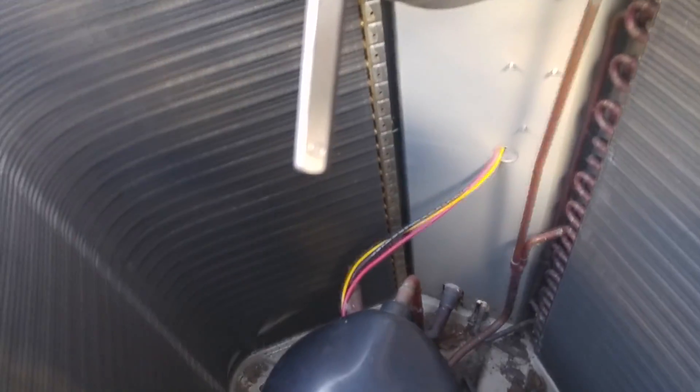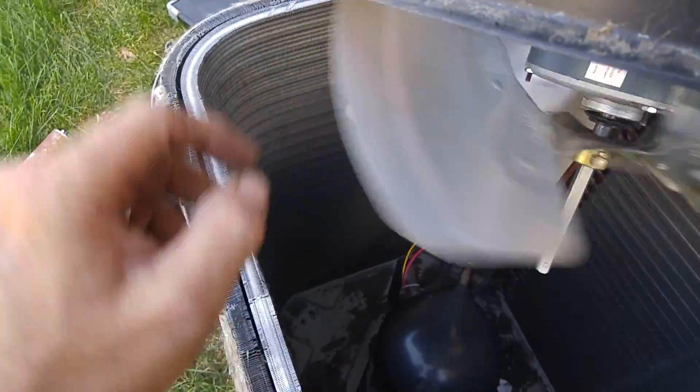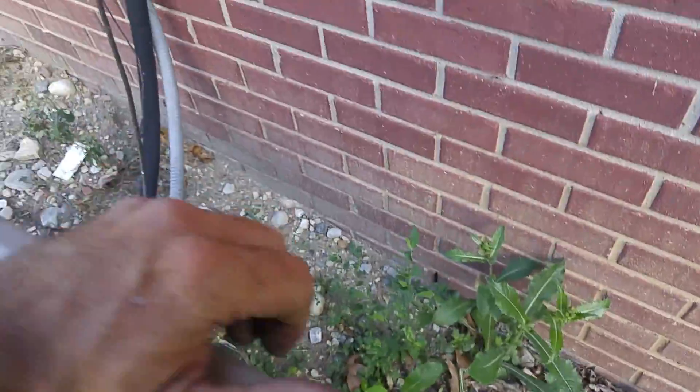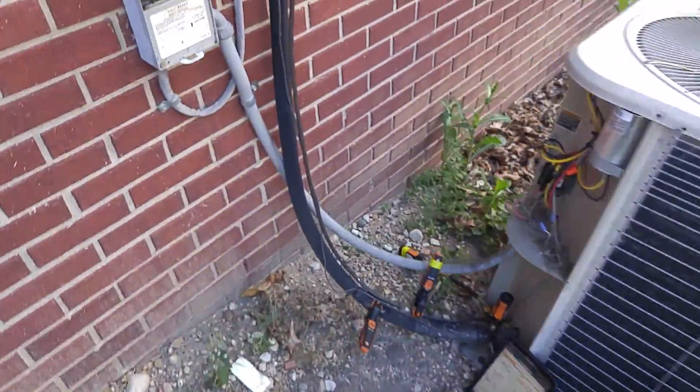This is a retrofit motor, 1/3 horsepower. Let me move this thing up on the shaft and we'll see what difference it makes. You've got to understand, it's only 72 degrees outside, so I'm hanging around that 180 area. This is all about fan blade placement. You can see where it was set — way down there at the bottom. Now I've got it up at the top. Let me give it a spin. Okay, we're good to go.